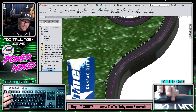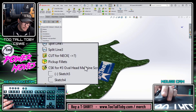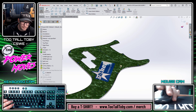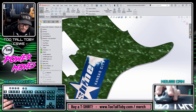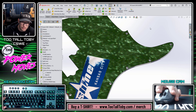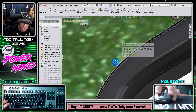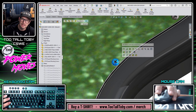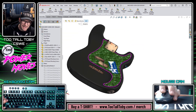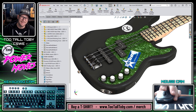Once again, I think it bears repeating: if I ever decide I need an additional hole with a screw in it, all I need to do is go back to the original pattern — in this case the hole wizard feature — create one additional point where I want the new screw, exit the sketch, return to the assembly, and SolidWorks automatically populates that new hole wizard location with new hardware from the pattern driven component pattern.